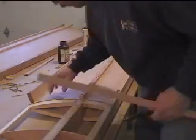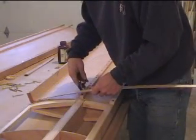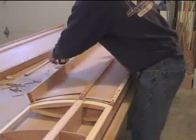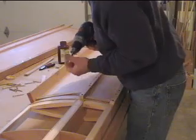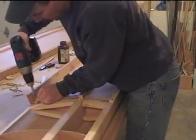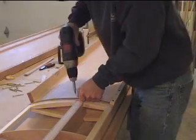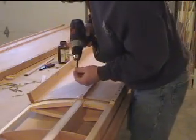What I do with these butt joints is take some of that 1/8 inch plywood ripped into 1-inch strips and cut up here. I use number 6 wood screws to screw this down. It has to bend, so that's why I use the thin material. You can see the glue is squeezing out.